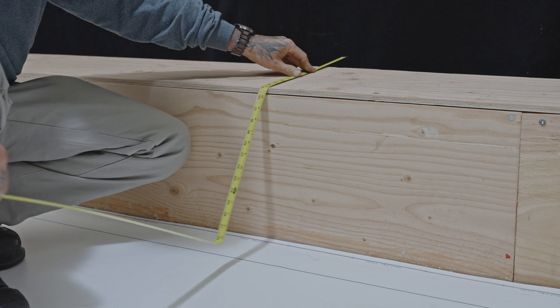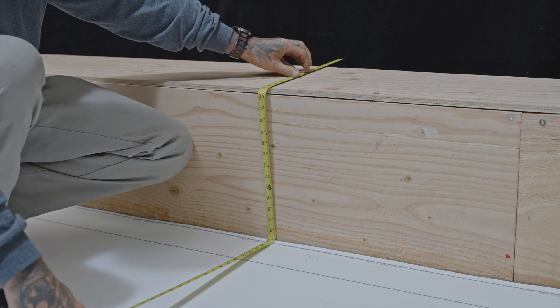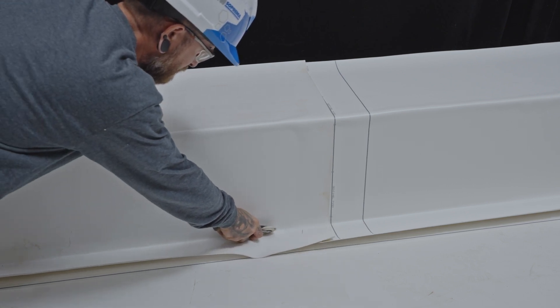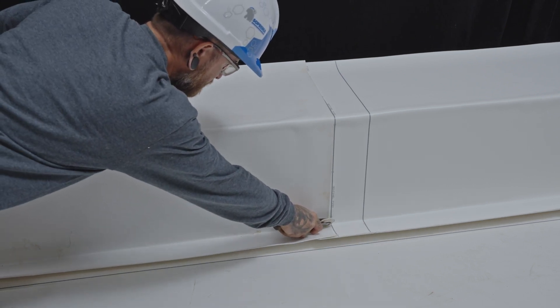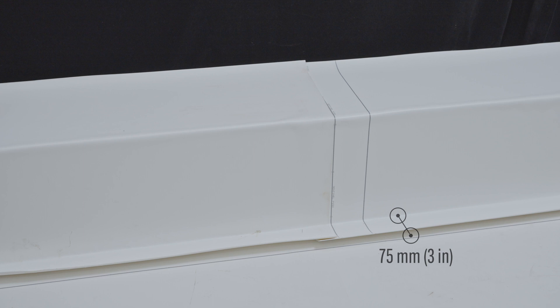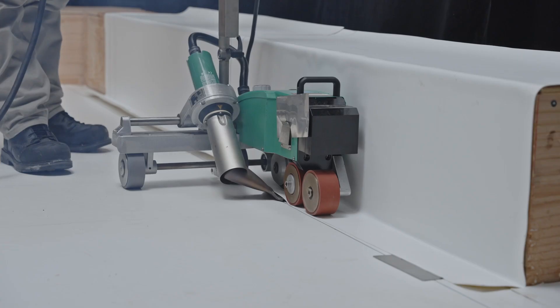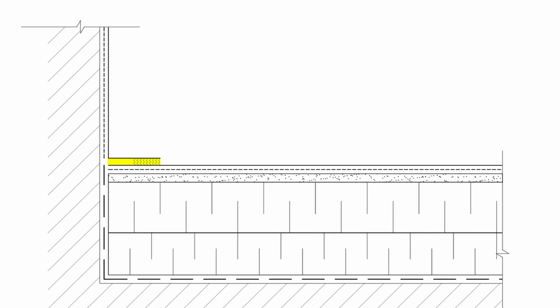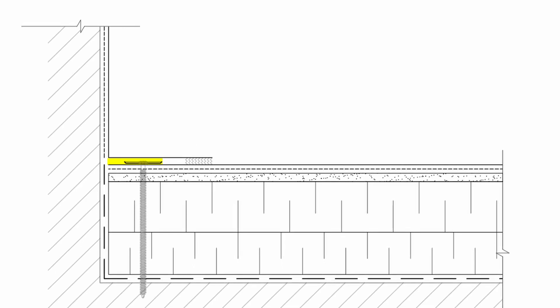To begin, take measurements of the parapet to determine the length of the membranes. The flashing membrane must overlap the field surface membrane to obtain a welding space free of fasteners of a minimum width of 75 millimeters. This will accommodate a 38-millimeter seam weld. You must calculate an overlap of at least 75 millimeters when there are no fasteners at the base of the parapet, and an overlap of at least 150 millimeters when there are fasteners.